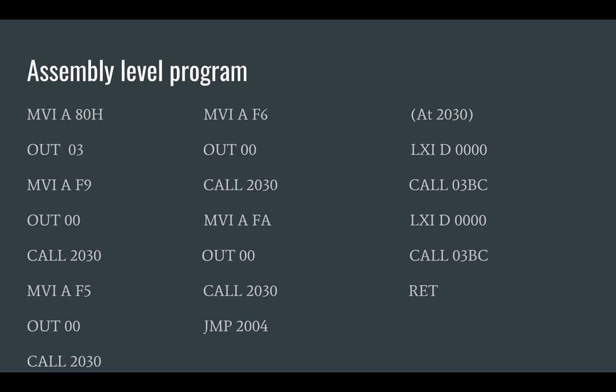Now, the value being passed is 80 in hexadecimal. The highest order bit of the 8-bit control word format is used to set or reset mode for the port — it is active high. The next two bits are mode select bits for group A of the port. As the stepper motor requires mode 0 type of data transfer, they are set to 0-0. The next bit specifies whether port A is being used as input or output; here it is deployed as output, so this bit is set to 0. The last four bits are used to pass parameters for port B and C and are irrelevant for the current task. Therefore, the first four bits need to be 1-0-0-0, that is 8, and therefore the value being passed is 80 to the control register.